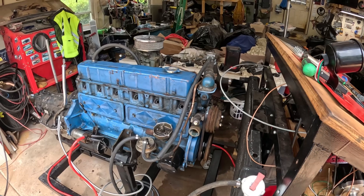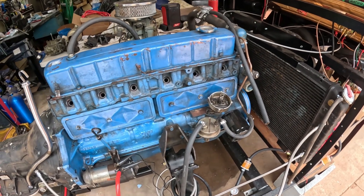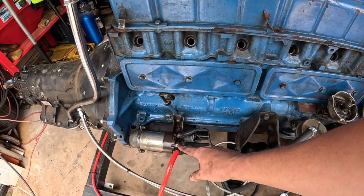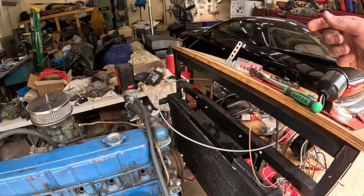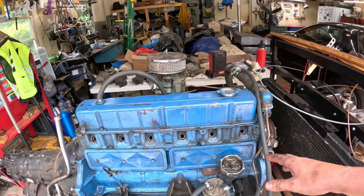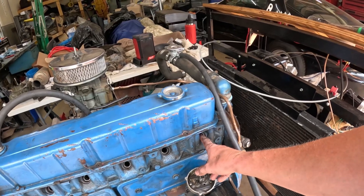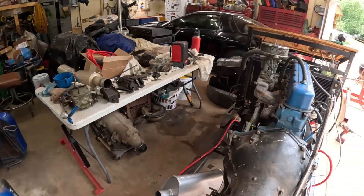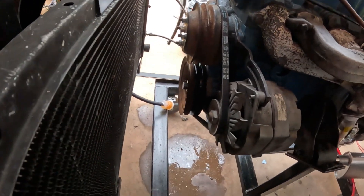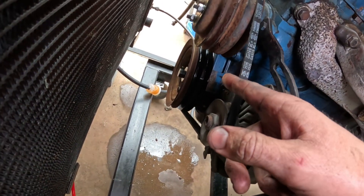I could be 180 degrees out. Instead of trying to knock out all this wiring — which would slow me down by a few hours — I have jumpered our battery wire to our start wire, so when I hit one of these switches it should spin over. I removed our spark plugs because I want to feel when we have compression coming out of number one, since right now we're lined up on top dead center. It's almost right there on zero.